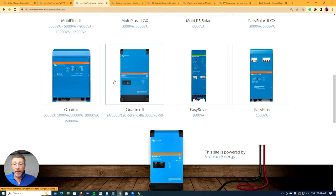In an off-grid situation, I like to use the Quattro so you can have two backup generators — maybe a small one for backup and a larger one for main use. Victron have changed a lot of the programming these days where you can adjust the generator input from the screen as an end user without needing config files. So if your big generator failed, you could rewire to the smaller one and adjust the generator input on screen so you don't overload it.